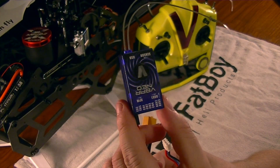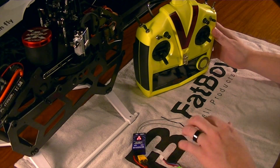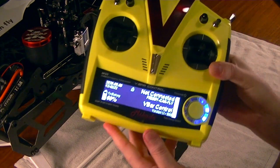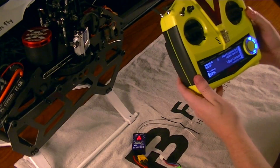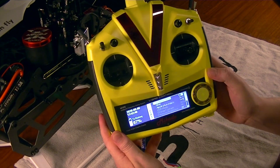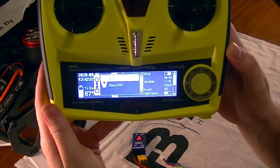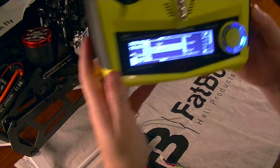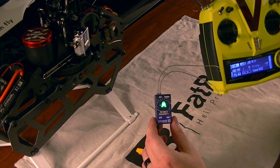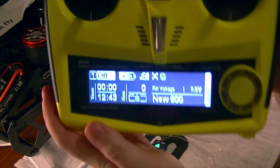Give it a couple of seconds to go into pairing mode. Boom — green and red. My transmitter is off, so I'll go ahead and power up my transmitter. On the transmitter it shows as not connected — we are currently not connected to any V-Bar Neos. All you really have to do for the binding process is scroll your wheel, go to transmitter setup, and literally it says right there: bind. It'll actually search, and once it picks up my V-Bar — boom, right there — it says new 600. You click on that, and the V-Bar goes to a solid green, and the transmitter says connected. You can see at the top a series of different indicators showing it has been connected.